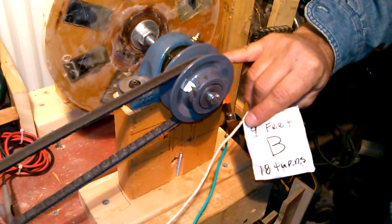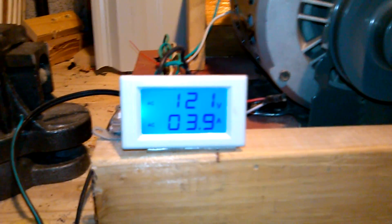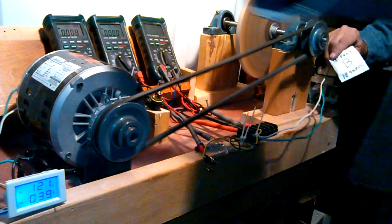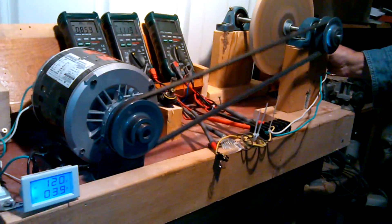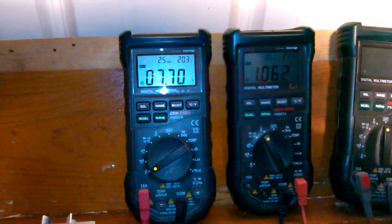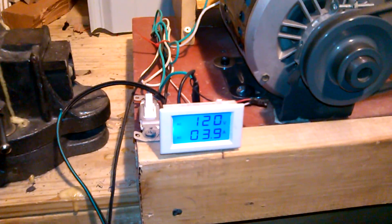Here's our next test, which is coil B — and again, this is the full shorted-out test. What I want to show you here is the volts and amps. He's going to put the coil right up against the rotor and you'll see that they don't change. You can see that hasn't changed. The shorted-out amps and shorted-out volts — and I'll show you there's hardly any force needed because you just hang it onto the coil against the rotor. The amperage draw for the motor has not changed from what we started with.